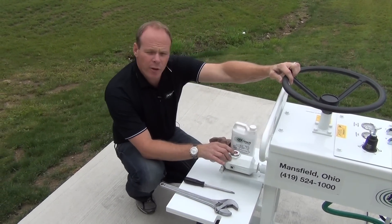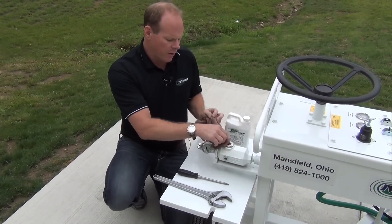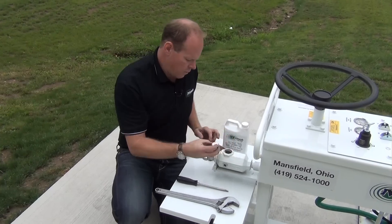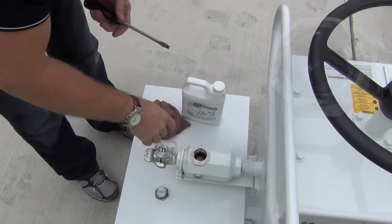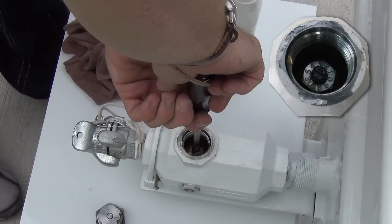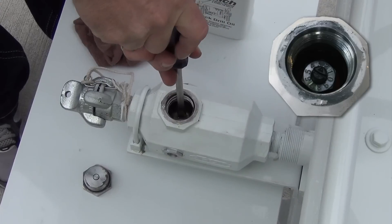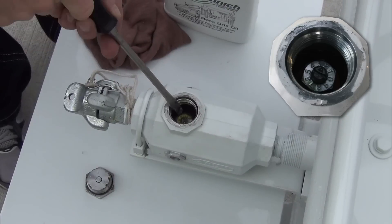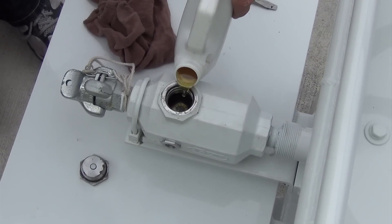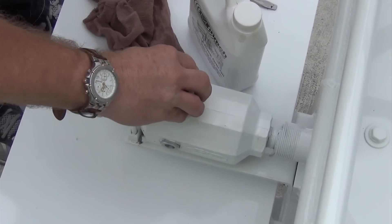The oiler — we want to fill this at the beginning of every day and every four hours. Before we open it, we want to press the red safety valve to let any extra air out. With a crescent wrench we can open that up. Now we want to fill it to the bottom of the threads, but we need to set the gauge that allows the correct amount of oil to come through to the drill. Turn it clockwise all the way until it stops — that's the closed position. See where the arrow is indicating, and turn it five and a half increments up. This one right now is reading at five and a half because it's zeroed out at the zero point. Then we add our oil just to the bottom of the threads, and re-tighten the safety cap.